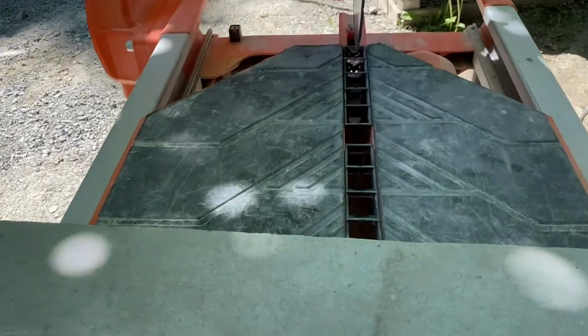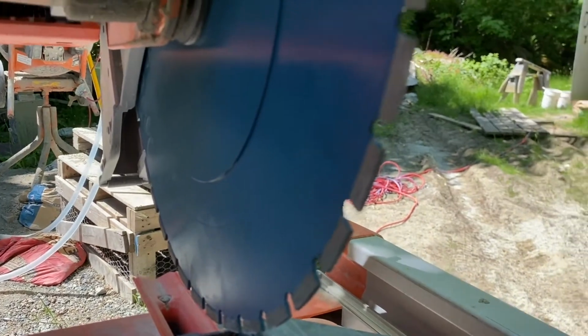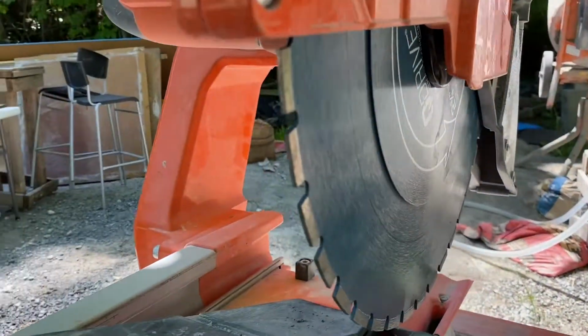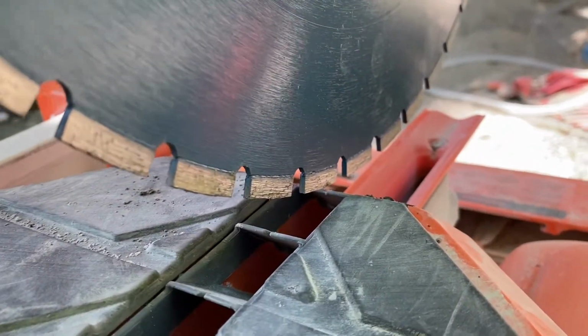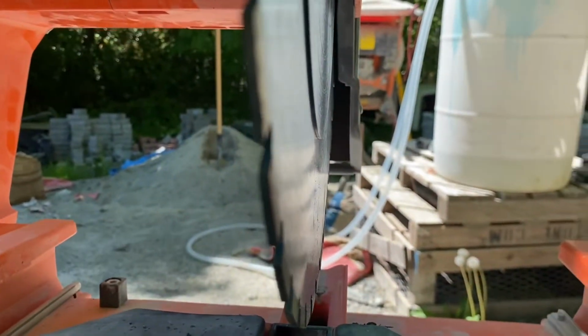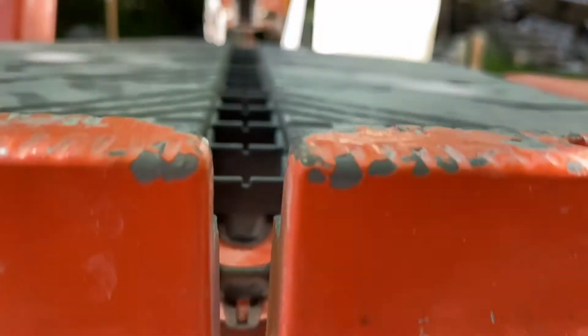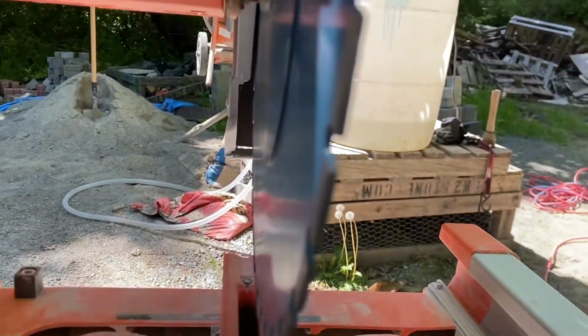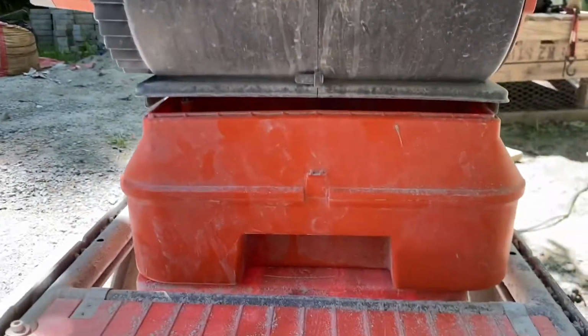And while we're switching the blade, I replaced the louvers so that we're going to have optimum dust collection down through them. So they simply slide out and you pop new ones in. And you can see the difference between the larger gaps of the hard concrete blade here, like bigger segments in between, and then the finer blade for porcelain and natural stone tile. So there's the fresh louvers. We actually cut into it a little bit on the first go so that you have a really tight gap there for dust collection to get through, and dust collection back through the cowl on the blade as well.